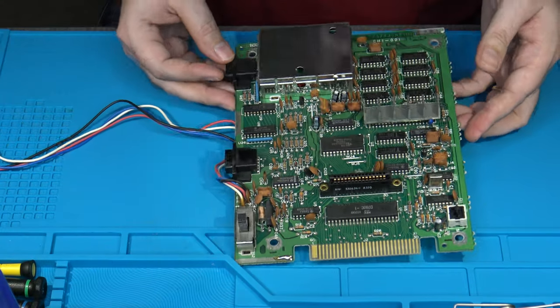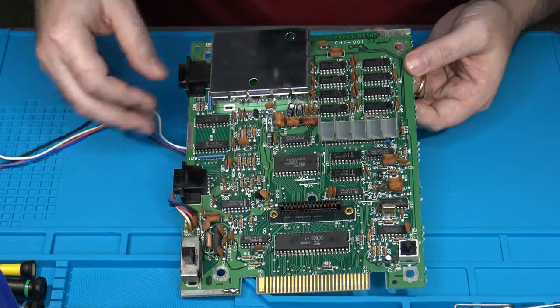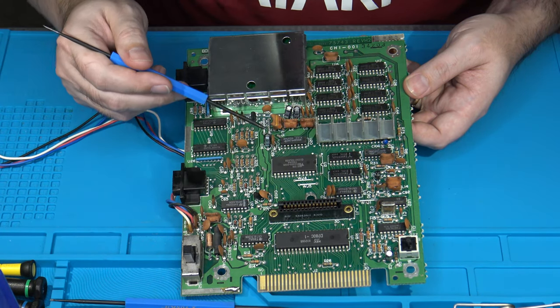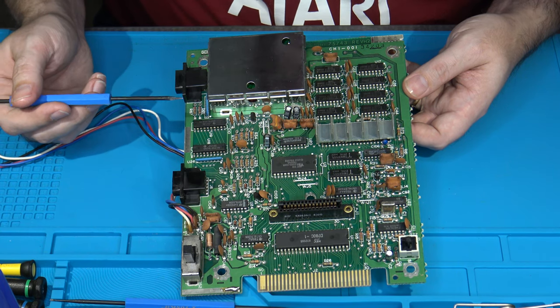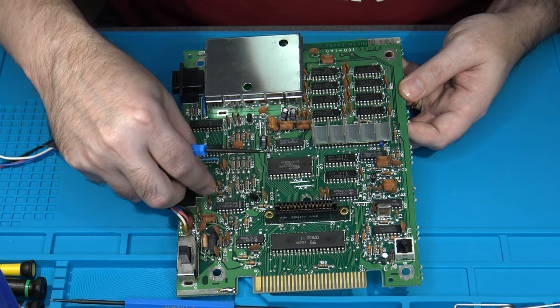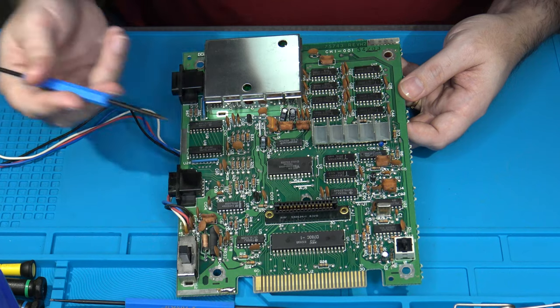Now there's not really a whole ton of capacitors on the ColecoVision board. I can point out the easy ones to see right now. We've got one electrolytic here, we've got another one here, we've got two more right here. And so really that's all we've got on the top part of this ColecoVision anyway, is just those four. I'm gonna straighten up these old ceramic disc capacitors. It always bothered me when I see them folded over like that. That seems like an easy enough task, right?